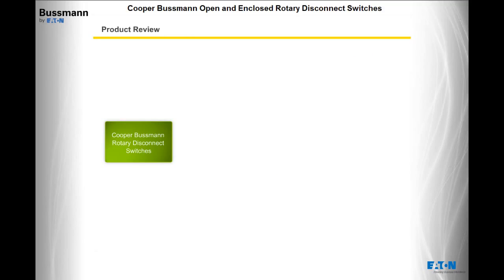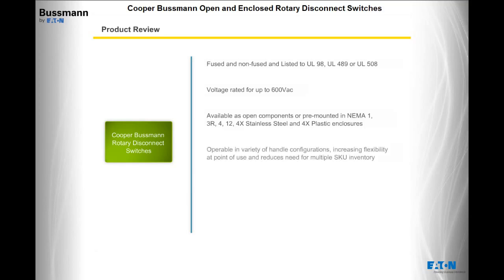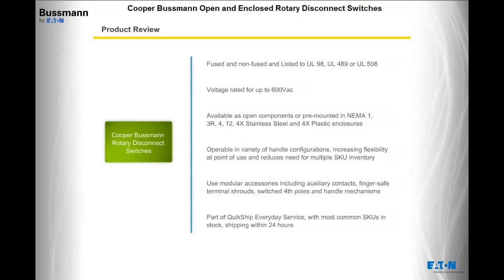You have come to the end of this module on Cooper-Bussmann rotary disconnect switches. Take a quick look at some of the key takeaways. The Cooper-Bussmann rotary disconnect switches are available in fused and non-fused versions and listed to UL98, UL489, or UL508. Are voltage rated for up to 600 volts AC, are available as open components or pre-mounted in NEMA 1, 3R, 4, 12, 4X stainless steel, and 4X plastic enclosures, are operable in a variety of handle configurations, increasing flexibility for configuration at point of use and reducing need for multiple SKU inventory, use modular accessories including auxiliary contacts, finger-safe terminal shrouds, switched fourth poles, and handle mechanisms, and are part of the Quick Ship Everyday Service, with the most common SKUs in stock shipping within 24 hours.